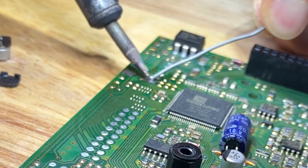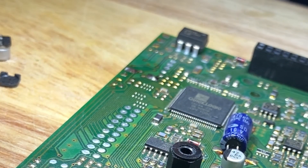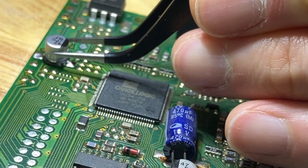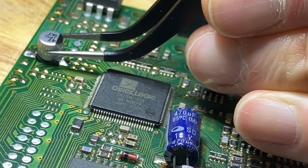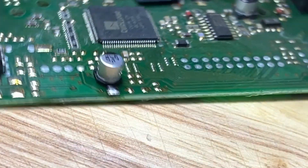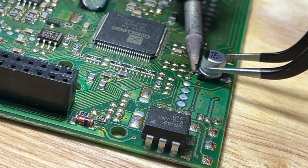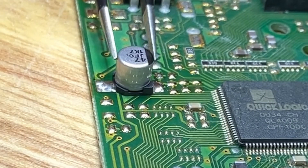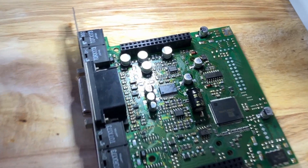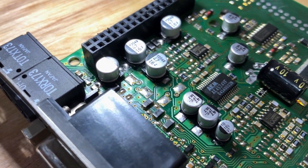There is the prepared pad ready for the new capacitor. I re-tin the cleaned pads, then place the new capacitor down in position, remembering to check the polarity is the same as before, and solder it in place. A little wiggle to make sure it's well bonded. Finally, here is a flyover showing all of the replaced components on the daughter board.